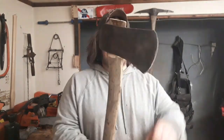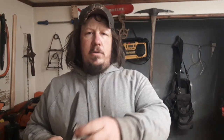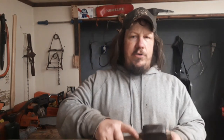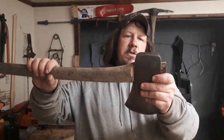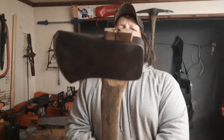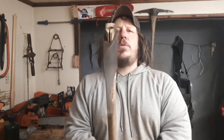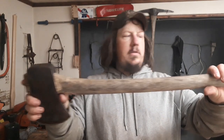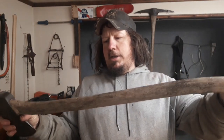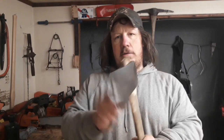We started with an axe — it was all beat up, had a loose head, bad haft to start with, shallow kerf, a little bit of rot on the end there. We dropped it as long as we could on that shoulder, tried to get it to fill all the gaps and cracks. It'll do the job — put a wedge in there, it'll probably hold for a few years. But I don't like it. Can't save them all. I'm going to keep this chunk of hickory though, in case we come across something with an oddball head or hatchet head — we'll make it work. Can't save them all.